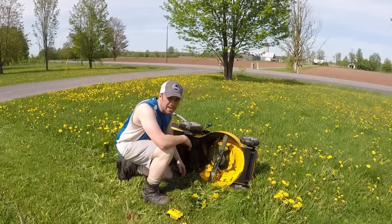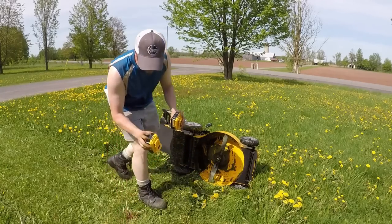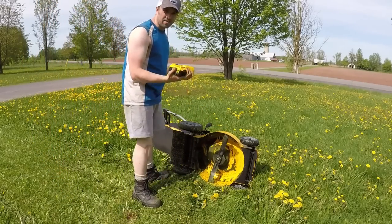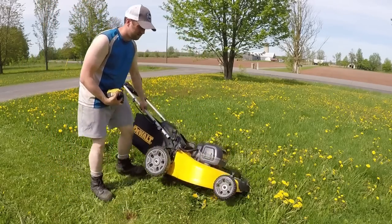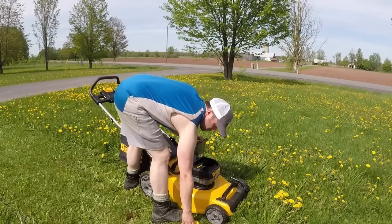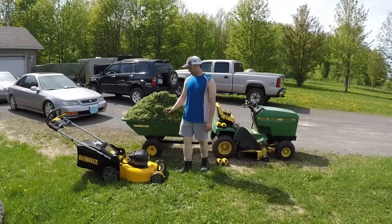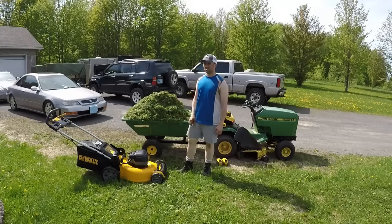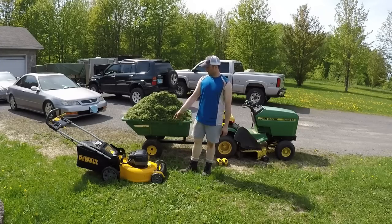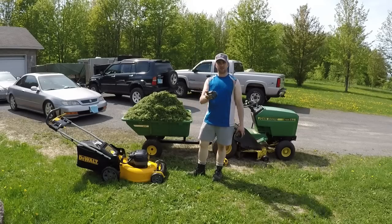I cleaned the deck out and emptied the bag — the 9-amp hour batteries are now dead. What I'm going to do is swap the 9s out and try the original 5-amp hour batteries, which have been cooling off for about 30 minutes and are both at half charge, to see how much more grass I can get. The 10-cubic-foot trailer is filled pretty high. The 5-amp hour batteries did about 3,000 square feet, and the 9-amp hour did 5,000 square feet with pretty thick grass. Now with two 6-amp hour FlexVolt batteries I'm going to do the ditches and see how it does.